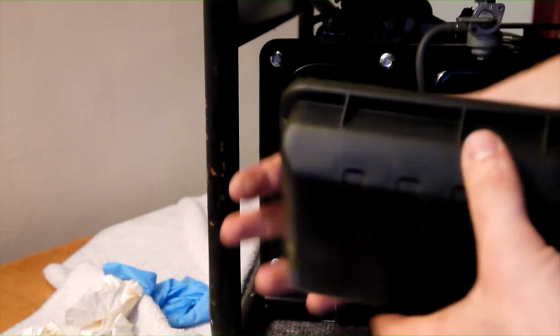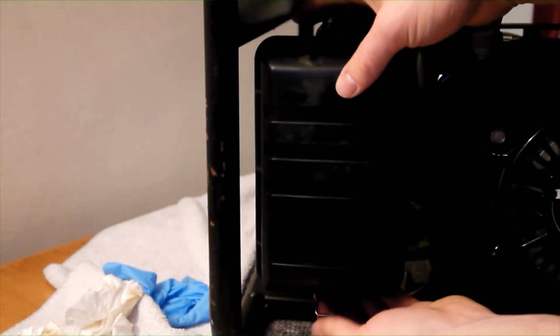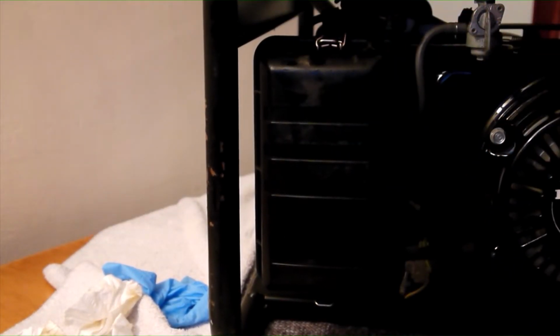Locate the air filter cover over the whole assembly, noting that the air intake cover louvers should be facing downwards. Simply snap the upper and lower clips over the front, locking the whole cover in place. Finally, check the choke lever is free from obstructions, and having turned the fuel supply on, carefully inspect the carburettor for any fuel leaks.